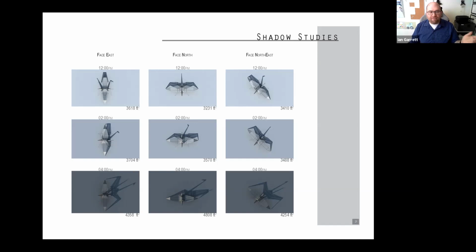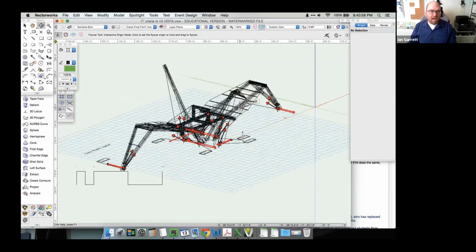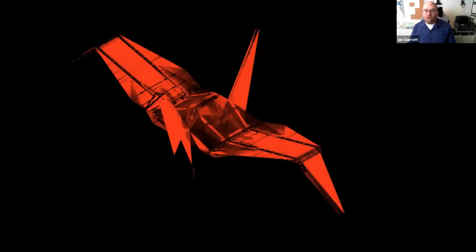Another challenge is that we would never see it in person until it was actually constructed on site. So a lot of it happened through visualization. So this was the early, decade ago visualization of taking engineering files and doing the renderings. Also, many LED lights don't necessarily have the same point source, spot quality to them. So being able to do more traditional photometrics is not as useful, and more so now with many of the lights that have been adapted for theatrical use. So a lot of engineering work going into the back of it, trying to come up with a rendering that we would hope would look like this.